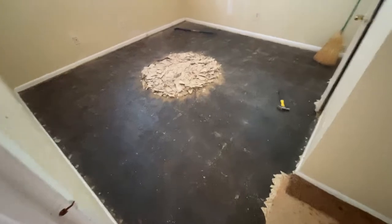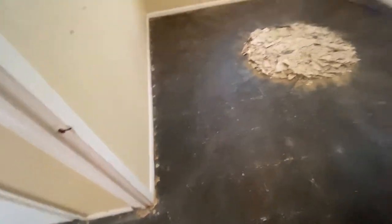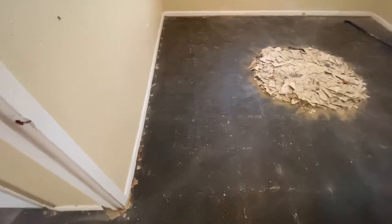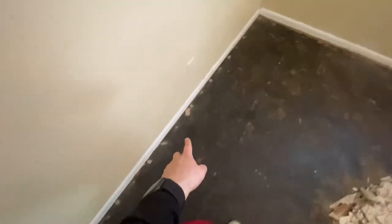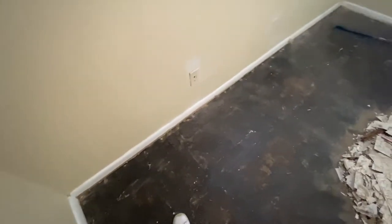About an hour later, as you can see, I have pushed everything into the room. I do that so I can really see what parts haven't been scraped up off the floor - it helps me get a good idea of where I'm at and how much I have left. The concrete along the sides of the walls has really just chipped up pretty badly. That was because of the tacking strips, and they were a huge pain to get off, especially on that wall. I don't know who had the bright idea of tacking them right up against the baseboard - it was really hard to get a hammer in there and pry them up. So I just resorted to smashing them in the side, and that really just popped up the entire piece. I was on my hands and knees a lot during this whole process, and I really wish I had used these knee pads, because my knees are absolutely killing me right now.